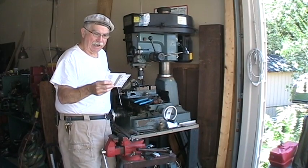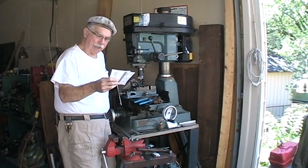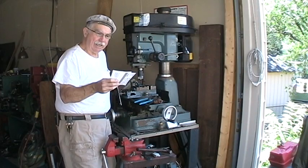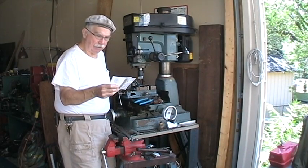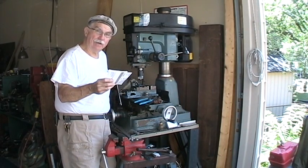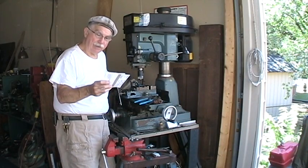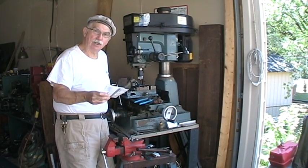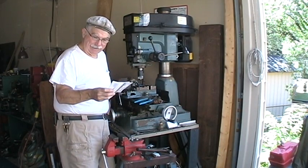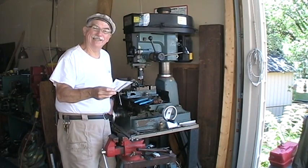I took the formula pi r squared equals area. I had the area 0.025 and needed the radius, and hence the diameter. So it would be 0.025, the area divided by pi, and you find the square root of that — that gives you the radius. It came out to 0.089, which means two times that: drill approximately a 0.177 drill.